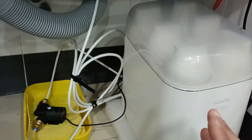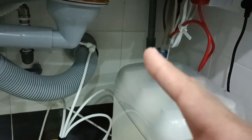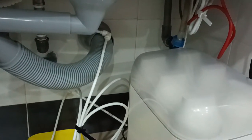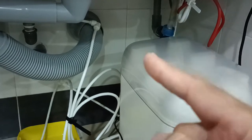Not forgetting that in your water pipe there are a lot of connections, like the elbows. When the water travels through these elbows and all the pipe connectors, you will have significant pressure drop. And if the water pressure is too high, these elbows, if they are not strong, will all leak due to the tremendous water pressure supplied by the pump. So we want to be on the safe side.